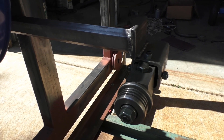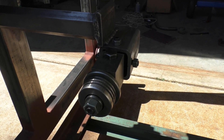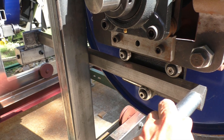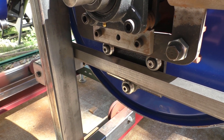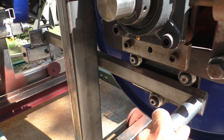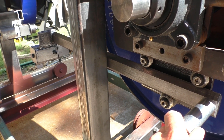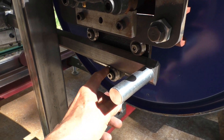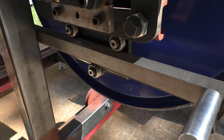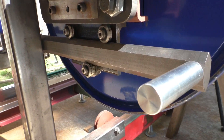On the other side I have this mounted on a sliding rail — that gives me about 12 inches of travel, about halfway across. I don't think I need anything shorter than that but we'll find out. These are some V-roller bearings. The two at the top are bolted in straight with some shoulder bolts I had laying around, and then down on the bottom there's another roller.